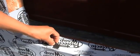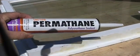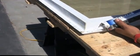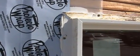This is a horseshoe shim that we've snipped so that it will fit nicely underneath the window. What Epi is doing is marking a position three inches on the right and left of the lower nail fin — these will be areas where we will not apply sealant. Now we're using a high quality polyurethane sealant. We're going to put a nice plump bead of sealant toward the outboard edge of the nail fin to ensure squeeze out around all points on the window. This is how a properly applied sealant bead should look — notice the gaps in the sealant in the lower right and left. When your sealant is correctly applied, you'll see squeeze out that should look just like this.